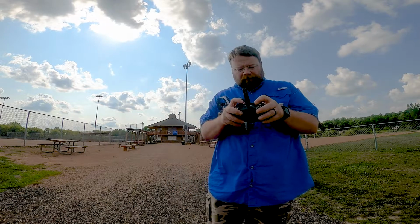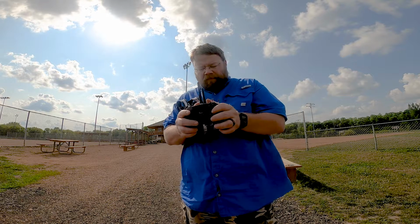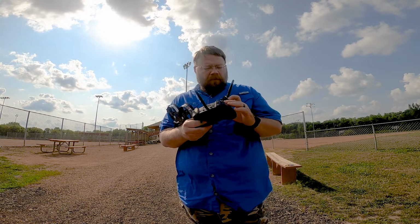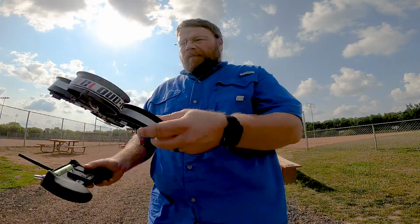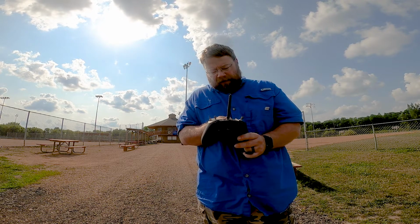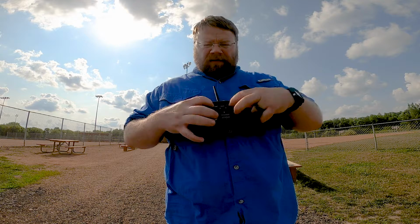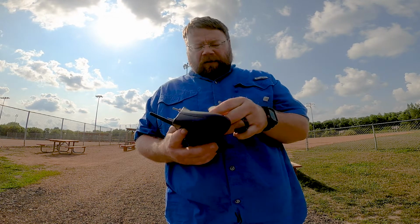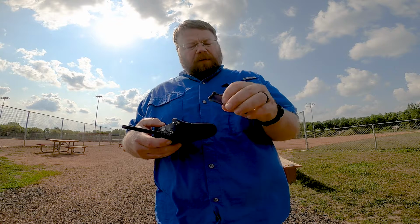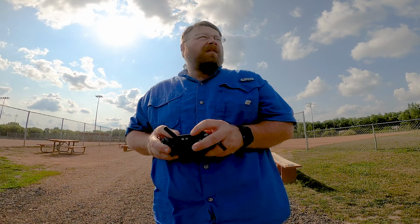Battery came out. I got it. Okay, so with the Jumper T-Lite, this is a good experience here. These terminals in here for the battery are not tight enough. So you just got to pull them out a little bit, and it holds it better. I might put a little piece of foam in here as well, just for a little extra cushion.